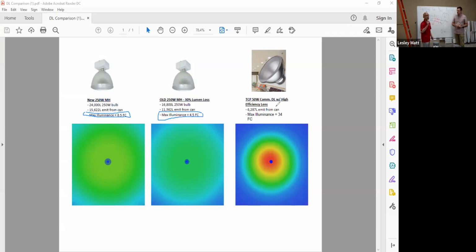Okay, now let me tell you a really sad story here. Would you guys tell me the standard? Is there any standard out there? Sure, there's what they call IES recommended light levels in foot candles. What do they recommend? Basically, in general lighting, not necessarily for working or drawing pictures, minimum probably around 20 foot candles. I would say no lower than around 18, 20. It depends on your application, but I would say 18 and up.